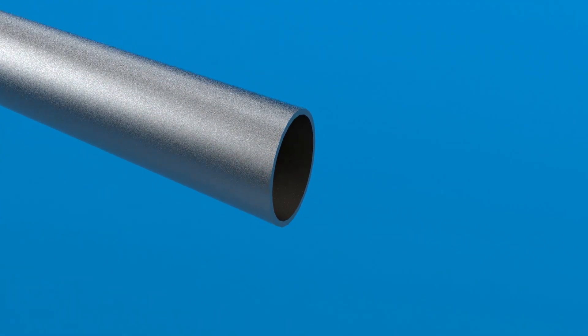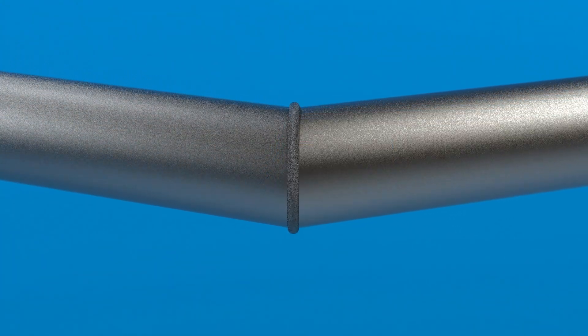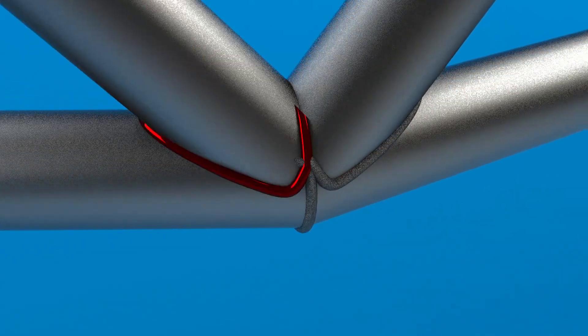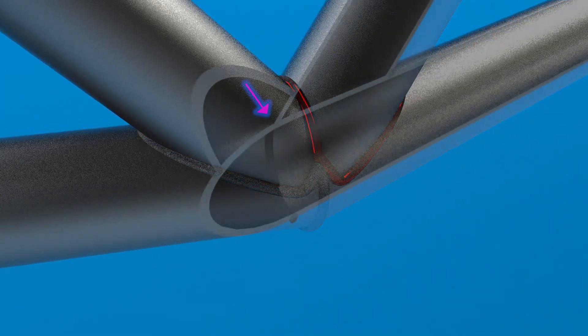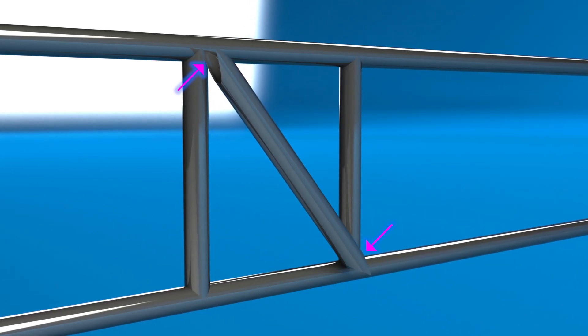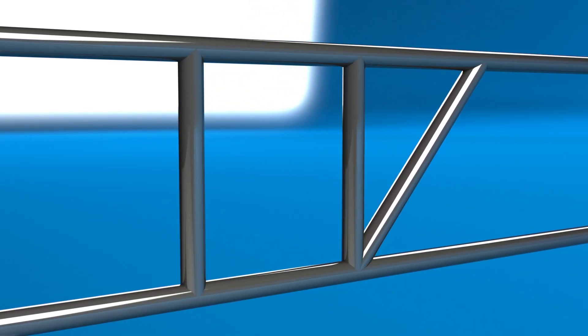The other critical consideration during design was the order in which the tubes would be inserted. If multiple tubes met at a single point, the cuts in the tubes would need to be done in the correct order — otherwise one tube might end up covering where another needed to be welded, meaning not all of the circumference could be welded. Additionally, parts like cross bracings may not physically fit if inserted after the surrounding parts were already in.